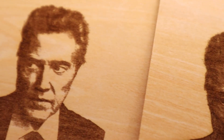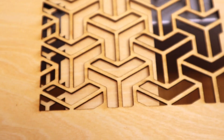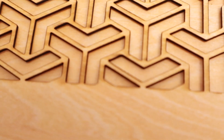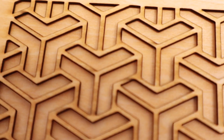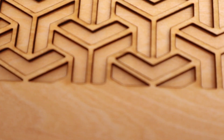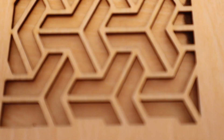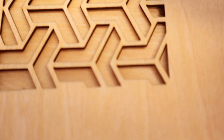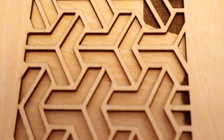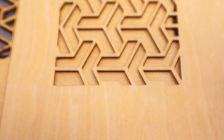The air assist is doing what it should be doing. The real test has to do with cutting, because cutting tends to be more intensive in terms of laser power and there's usually more burning. This right here was the one without air assist — for the most part it looks like a clean cut and it cut all the way through, although this is only 1.5 millimeter plywood, so it should. By comparison, this is with the air assist. It is a lot cleaner around the edges, with less smoke buildup. So it is a lot cleaner cut, and that matters because you want to cut down on post-processing and finishing.